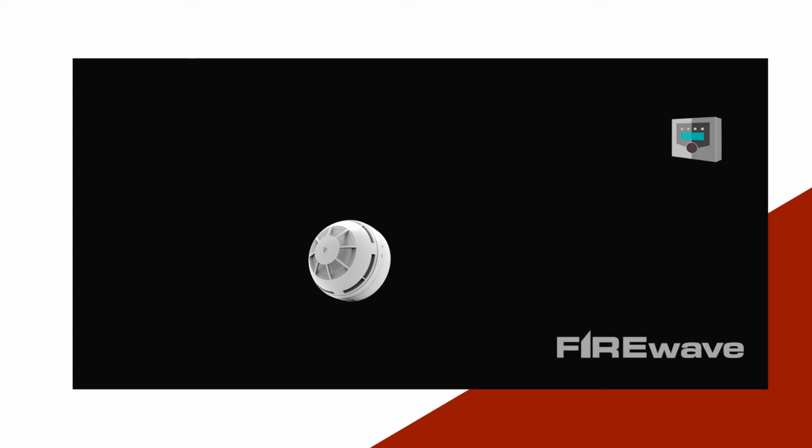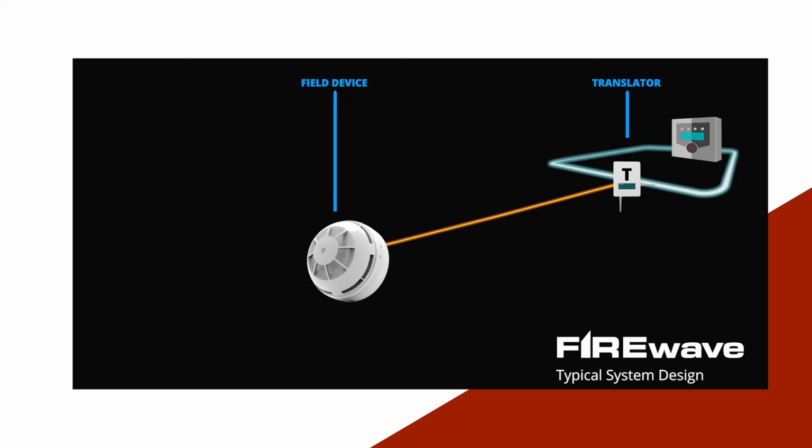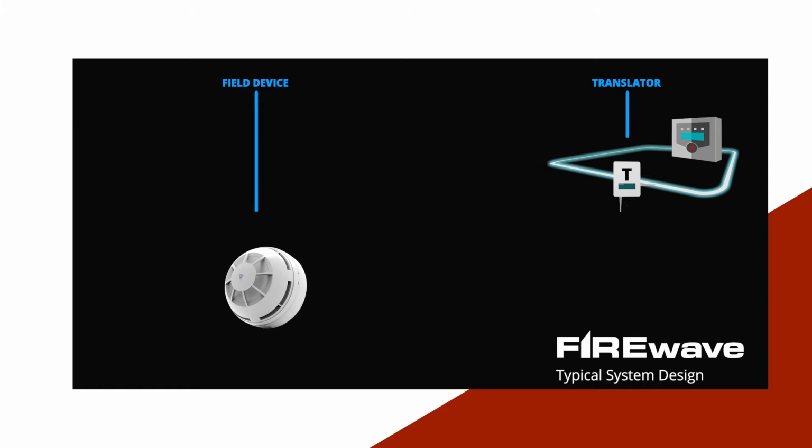In the FireWave system, each wireless device has been pre-programmed to communicate directly with a translator or a specific expander. And this would have been determined by the system design based on the signal strengths identified on the site survey.